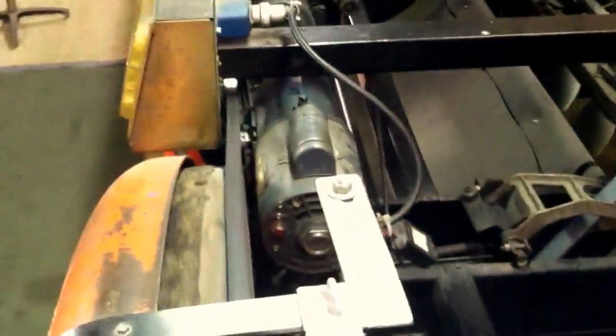Working off the electrical, you've got your back-end motor here, which runs everything in the back end. This spinning pinwheel — that big orange thing you see — brings the pins up. You've got your distributor here, which puts the pins in their places for the next ball. And you've got your pit carpet down there, that big green belt you see spinning along, which brings everything from the deck to the back, ready to go.